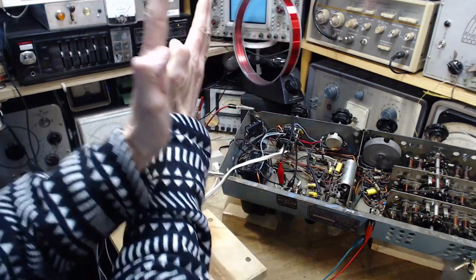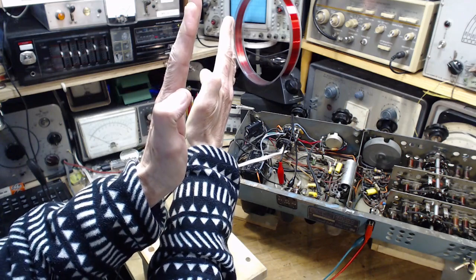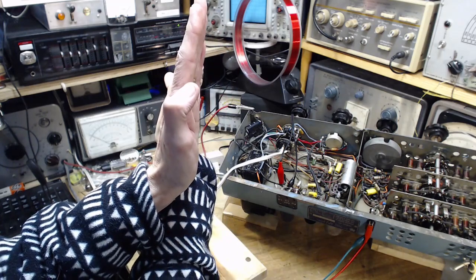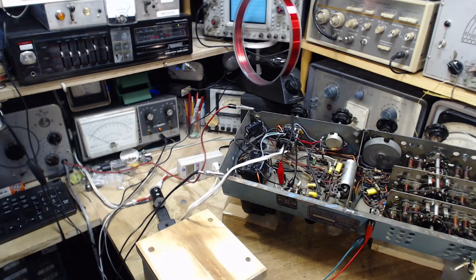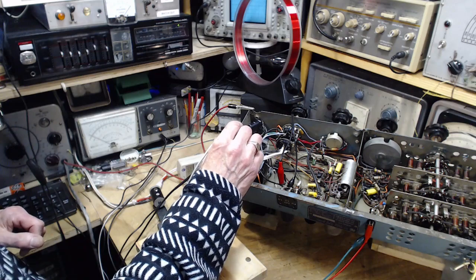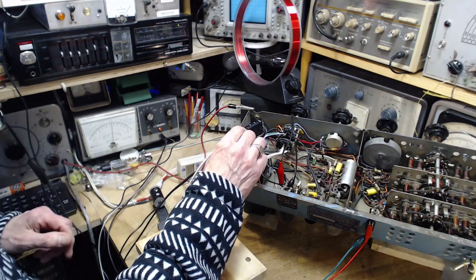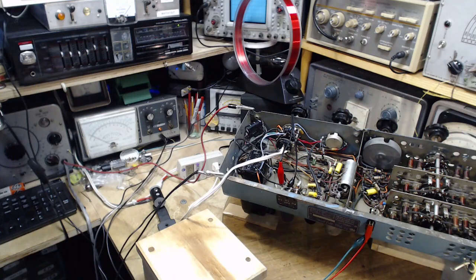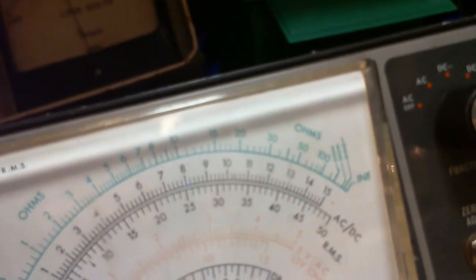And what you do is, and I'll show this to the camera, you're lining your head up, and when you move your head just right, you get exactly that's the reading. There you are, parallax. No other meters have a mirror behind them. Okay, everything should be stable, I think. Go ahead and check again. So very accurately there. I have to put my head right in front. Let's use the other camera here. Okay. Reading.